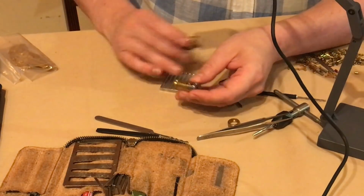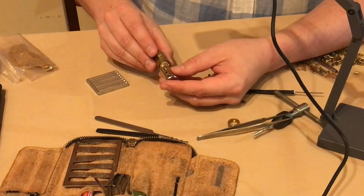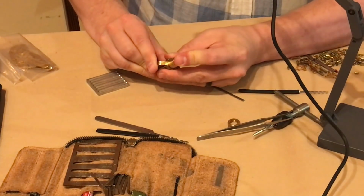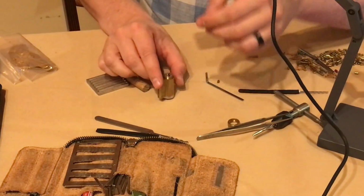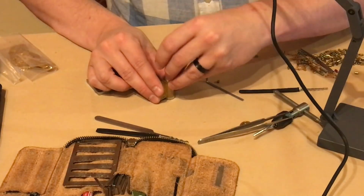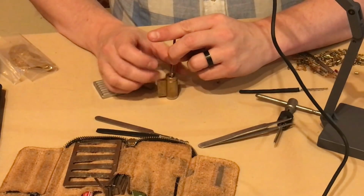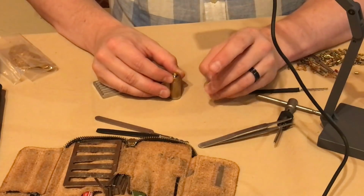If I push the plug into the lock, do I want it straight up and down? No, why would that be bad? Yeah, the pins are immediately going to start falling in the wrong chamber. You got to turn that at an angle. And then I just snap it back through. And here goes nothing. Click. So that has been repinned. I'm going to grab a Sharpie or something and mark a little challenge face on it. When you're locking your tail ring back on, just go all the way tight and then back it off by like one or two little divots.